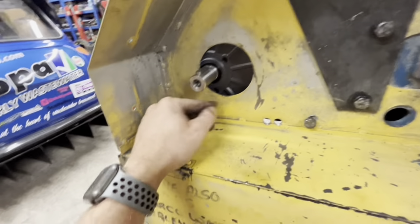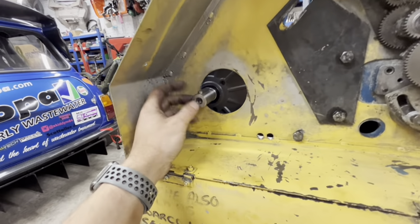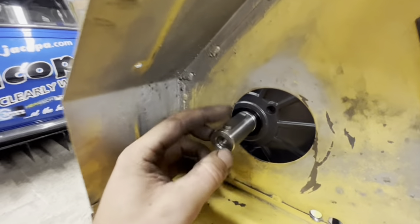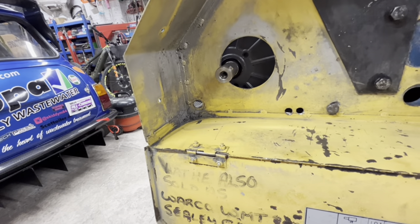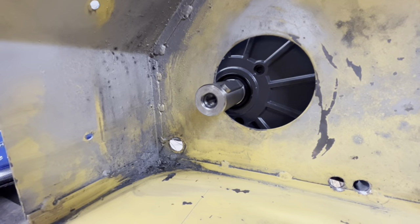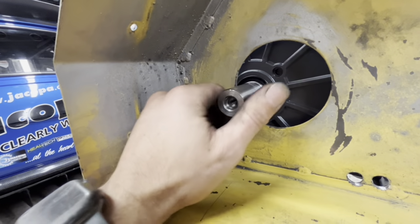Once we've done that, chop that out, and finish mounting the bottom, all we need is a sprocket or a pulley — like a one inch. We could probably machine one out of the ones we've got but I'm not going to be able to put a keyway in it because I don't own a broach — unless I do it in my mini machine and just cut it in, but it's not really going to work. I might have to think about what I'm going to do with that, but I think that just looks like a one inch normal V-belt pulley that'll go on there.